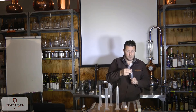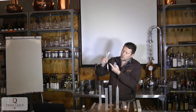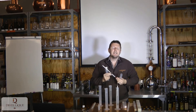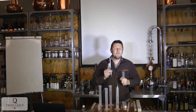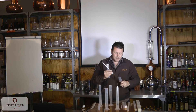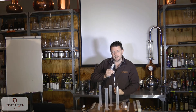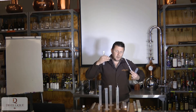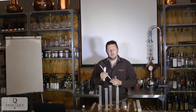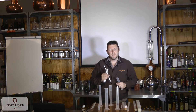Then we have the longest of the lot, which includes a thermometer. With the 0-to-100 alcohol meter with thermometer, the reason for including one is that when you measure alcohol — as noted on the stem — the meter is calibrated for a specific temperature. If the liquid is warmer it becomes less dense and the alcohol meter floats deeper; if colder, it becomes more dense and the meter floats higher. So the temperature of the liquid will impact your reading, and we need to know that temperature to compensate.